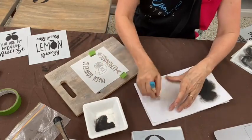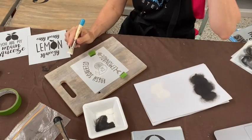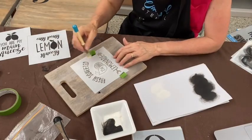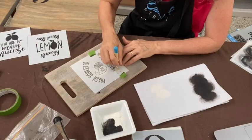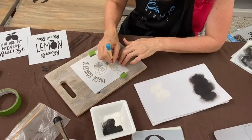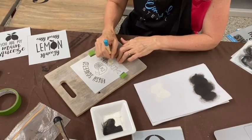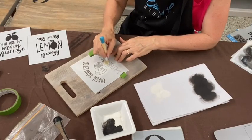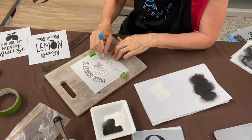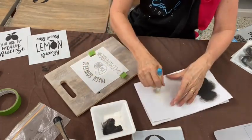Someone mentioned you could use a white wax. So there are lots of different companies who sell furniture wax and they also sell coloured waxes — you can get a white wax or a dark wax for an antiquing look. What they've done is tinted the clear wax and created it white. You add that to raw wood, especially older darker wood, and it looks really lovely — like a whitewash effect. Another way is to just drag your dry brush across the board with actual paint on it, not watered down. So there are a whole lot of ways to whitewash your furniture or sign boards.